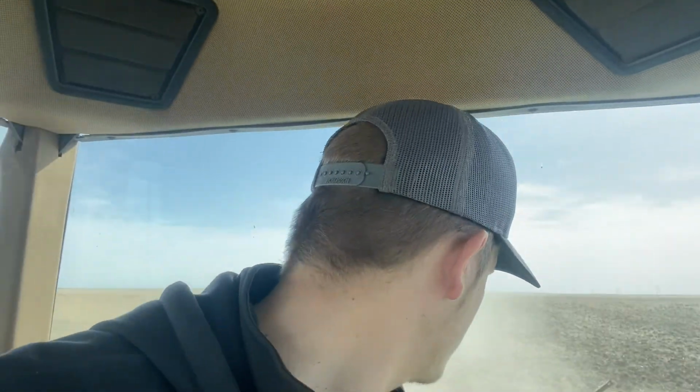It is a hard pull. I mean, it's been in grass for 15 years now and I had cows on it. It is a hard pull, but I was hoping it wouldn't be this hard of a pull. If it continues to get into the red some, even after we blow the radiator out, I'm probably gonna have to pull the chisel out a little bit more, which I don't really want to do. We're not going in too terribly far, and I'd also hate to do it midway through a field, but I also can't work for 5 minutes and sit for 2 or whatever it's gonna be. So I guess we'll see how the rest of the day goes.